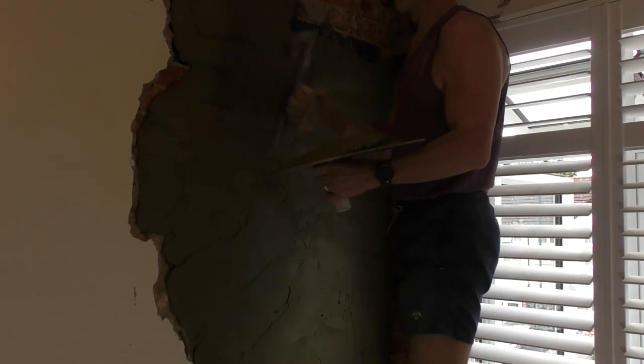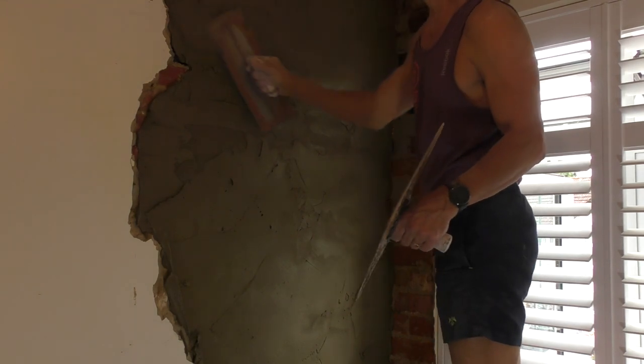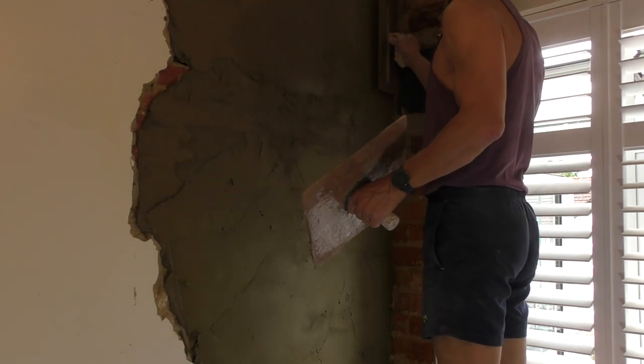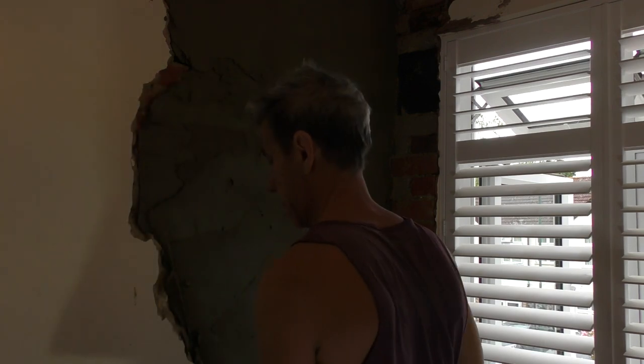So basically I've sprayed the wall just with a little bit of water. Brickwork basically doesn't need to have a bonding agent on it - specifically this is some kind of issue with the bricks and we're putting this coat straight on. I'm going to level it out flush with the existing wall, because this whole actual wall on this side is going to be skimmed over at the end, so this is going on in one coat.